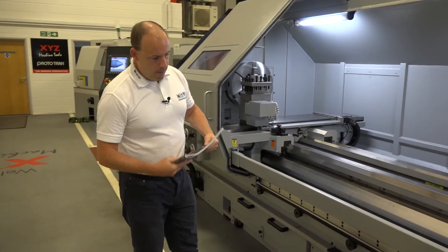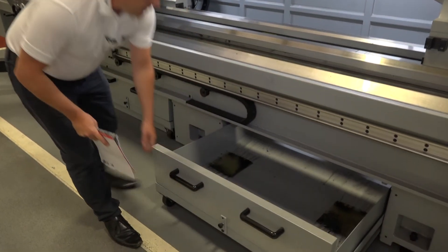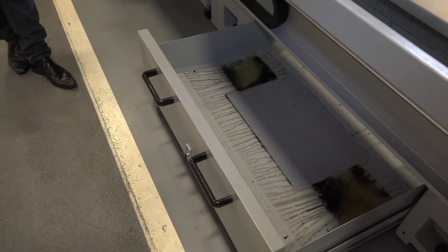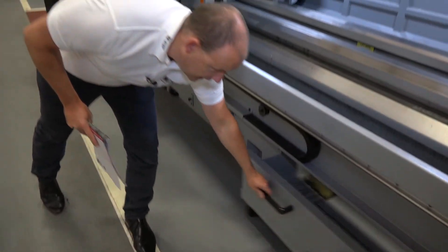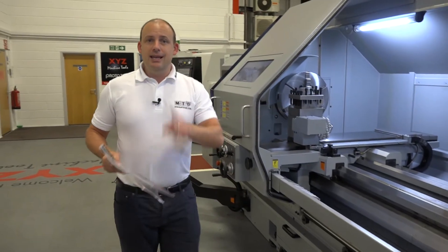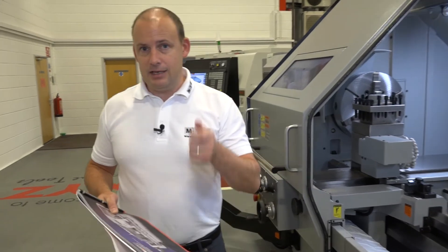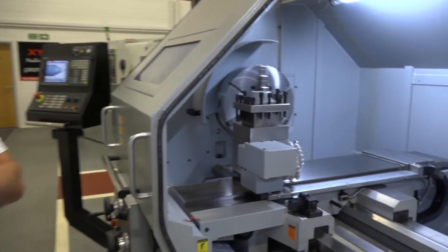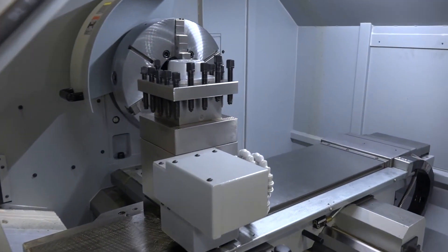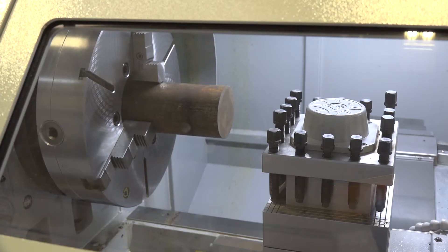When we talk about swarf — cutting metal, removing metal — you've got two swarf trays here where the swarf will fall into the bottom, and you can move them out and clear your swarf. Very easy to do. Let's talk about the tool post on this, because with this XYZ machine you get a four-station auto-indexing tool post. You can also have an eight-station one that can be auto-indexing, or you can opt for just a manual tool post. It gives you that flexibility with the auto-indexing to be able to program it in cycle.